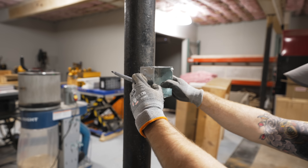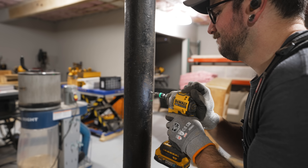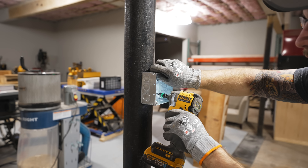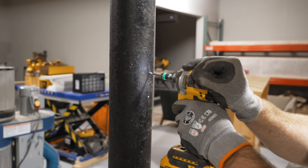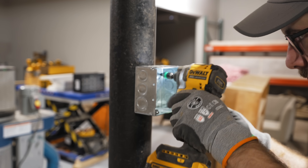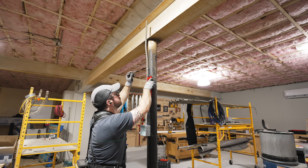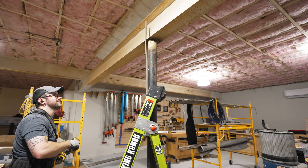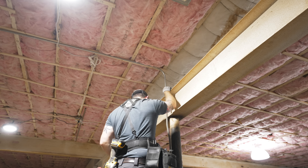With that done, I could go ahead and start mounting some of the junction boxes to these center posts. Since these were steel I needed to drill and tap some holes, and for that I used my favorite little drill-and-tap bits — these things are awesome. They drill the hole, tap the hole, and countersink the hole all in one quick motion. Then I just used some 10-24 machine screws to mount the boxes to the posts. The conduit bending work on these posts was a little bit tricky because I had to go around the beam up towards the ceiling, but it was just another offset and I used the bending app to get the measurements I needed.